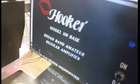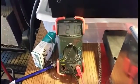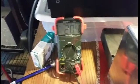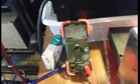We went through this thing and did a full rebuild, put a little twist on it. Got a big tall heat sink on here, positioned so the airflow comes through the transformer and through the fins of the heat sink and out the back through those four portholes — that's the only exit for air, and it works very well. Pretty much this has turned into a Hooker 350 if you ask me — it's no longer a Hooker 100. Let's go ahead and let you see this puppy in action. We've got the voltmeter here to show you the float volts and what it's dropping to.